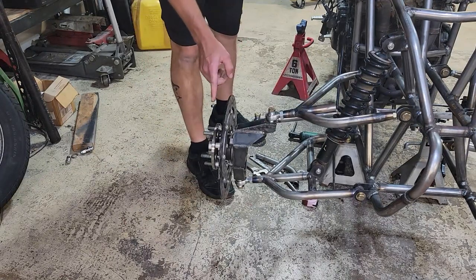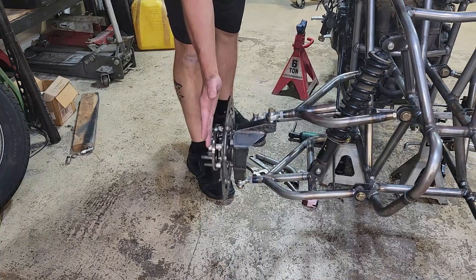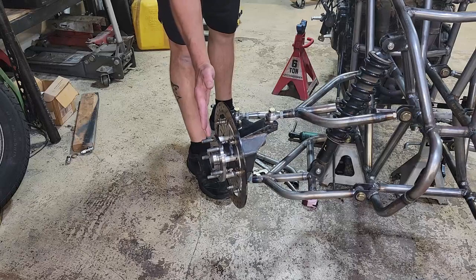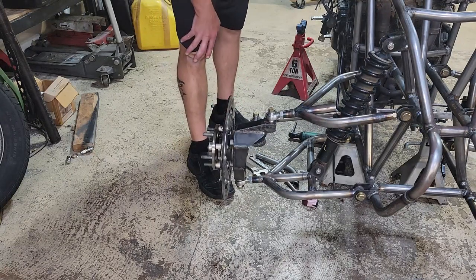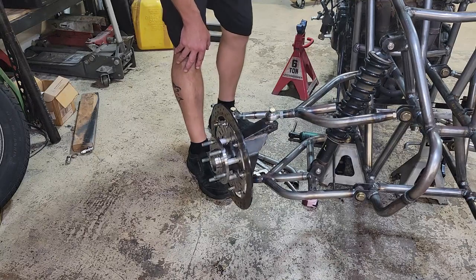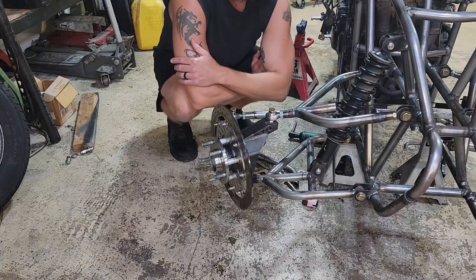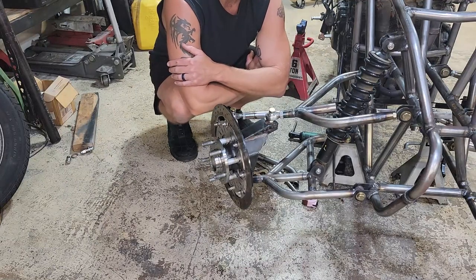The interesting thing that it does though, is the kingpin angle will tend to return to center after you turn. So it's going to cause the tires to want to go back to center. And I think that's a good stability choice to have for driving this thing on the street. I mean, I do think about safety. Speaking of which, let's mount some brakes on this puppy.